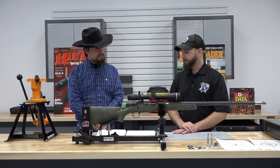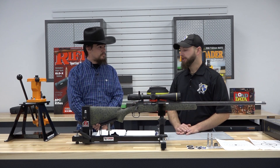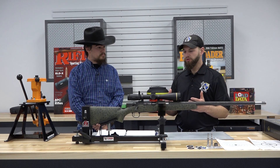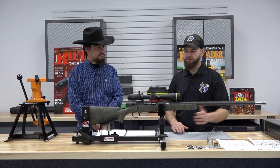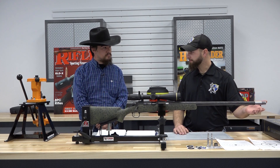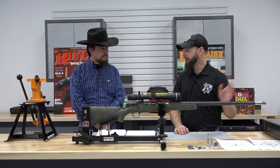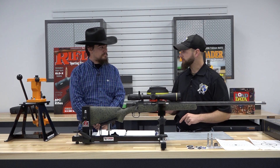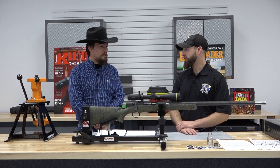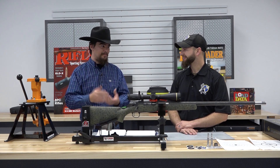Down to the muzzle, we did build a custom muzzle brake. We talked about it first and thought maybe we'd skip it, but after testing I said let's go ahead and put one on — so we developed a brake just for this rifle, and it helped out quite a bit. It's amazing the difference it makes. One of the things that's really common in our industry is if you're shooting prone, you don't want dirt in your face or your spotter's face. This brake in particular has no ports on the bottom, but there is 360-degree porting that ties in all the baffles and it all gets blown out the front. So you don't have to worry about gas being blown up. Prone shooting — there's nothing flying in my face, which is wonderful.